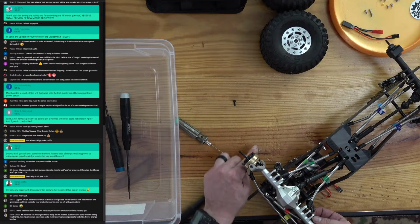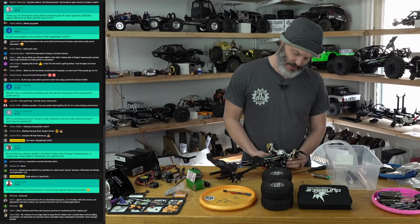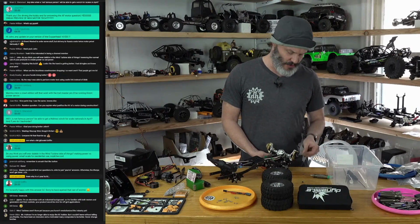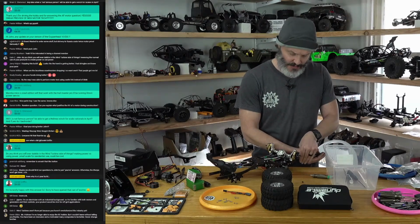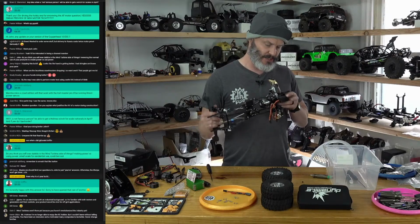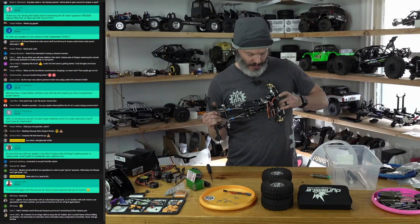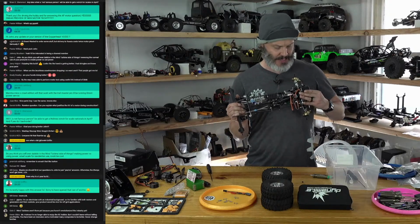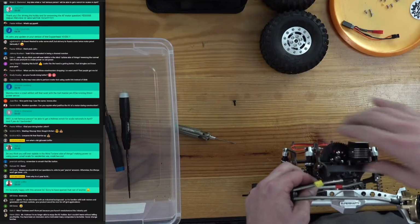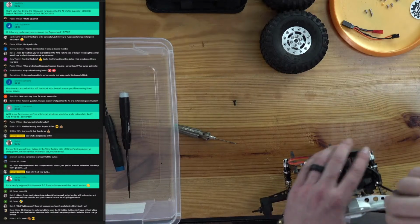Well, now y'all got me thinking about motor design. There are some rotor designs that we will be pursuing in the future that haven't been used in the RC industry yet. A lot of the reason is that we're just getting started with 32-bit processors in the RC industry. The quadcopters have been using them for a while, but they never really used the processing power as it could be used. There's a lot of processing power that the 32-bit architecture just doesn't take advantage of. But with rotors that aren't exactly permanent magnet rotors, all right, I need to turn that again. With 32-bit processing, it can actually control them well, and we can start to do some real fun stuff with back EMF. But it can't just be a typical salient pole topology.